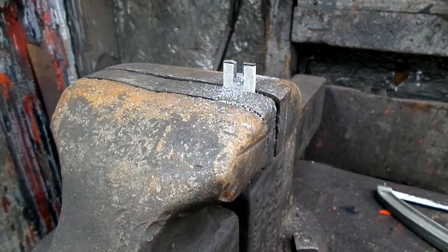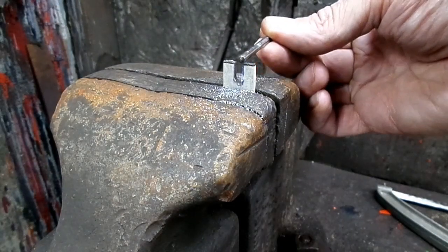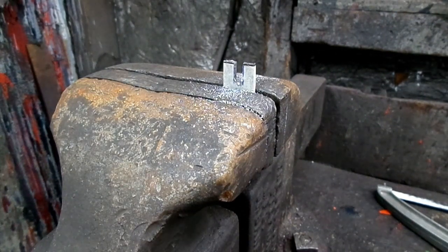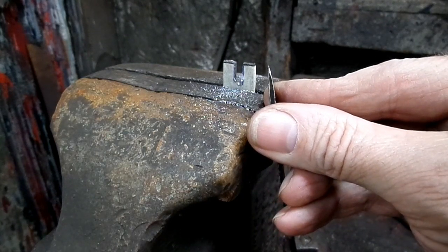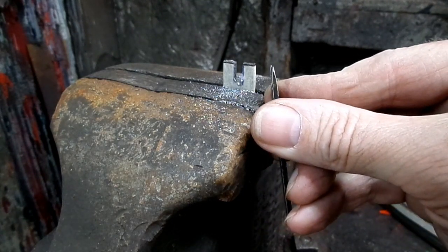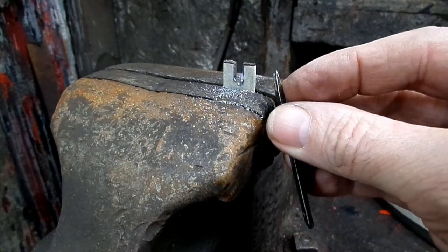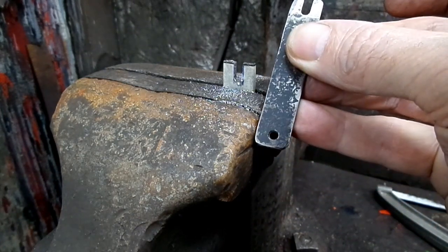What we could do is take our drill bit as a gauge. I think we're good to go there. Now, the tricky bit — if you look at the tool, you can see that she's tapered like a knife, and that's the part that makes the tool work. So we're going to chamfer — taper the ends there — and round the corners. Dress it up a bit on both sides.